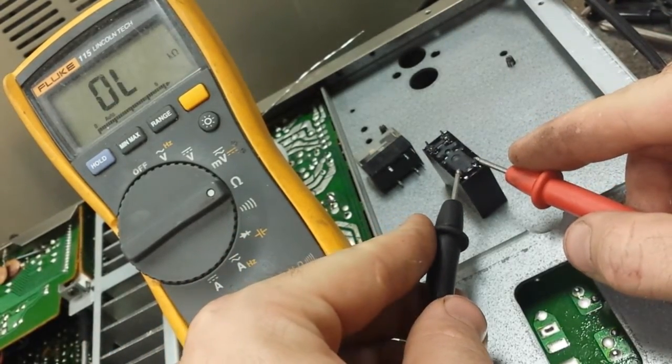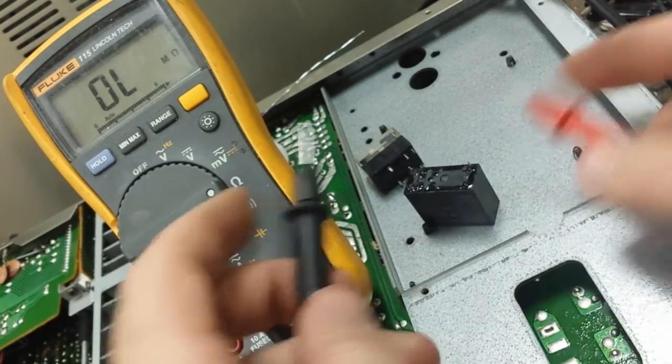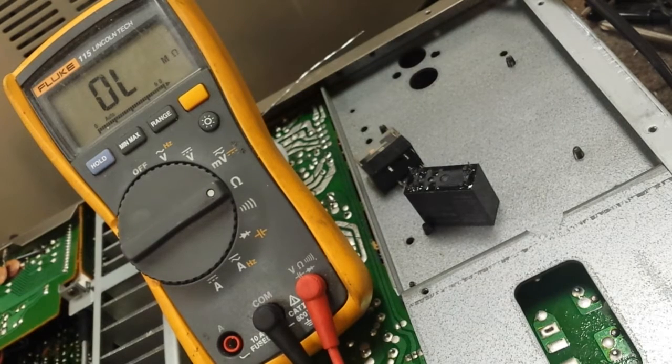Also make sure the coil resistance of the replacement is close to or slightly higher than the original. This replacement is 700 ohms versus the original's roughly 900-something ohms. You shouldn't just hope - you should look up the driver transistor firing the relay to check its current handling capability, then calculate the current draw using the supply voltage (24 volts) and Ohm's law with the 700-ohm resistance. I've already verified that the transistor they're using, a 2SD400, has enough current to power that relay. Check the datasheet online - nothing like putting a relay in and then a month later having the driver transistor fail.